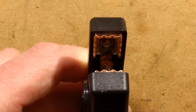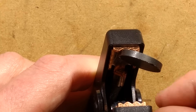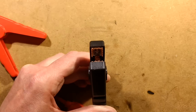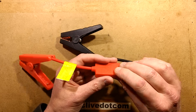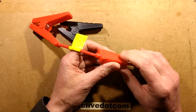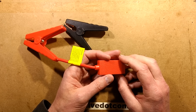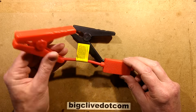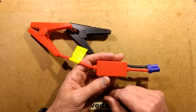When you look at the cable it looks coppery but also a bit silver at the end - I'm guessing that's copper-plated aluminium. Likewise, the coppery contacts at the end happily accept a magnet, so they're probably steel. What we're really interested in is this mystery red plastic slug, which I hope isn't solid - I hope it's hollow. Oh, it's flexing, it's hollow. I'm guessing maybe a thermal cutout, or maybe some active electronic circuitry - keeping in mind these are rated for hundreds of amps - or it could be a fuse.